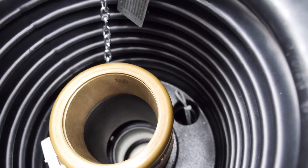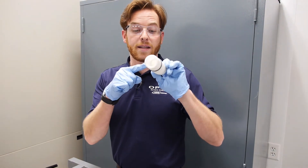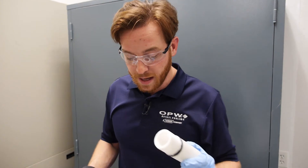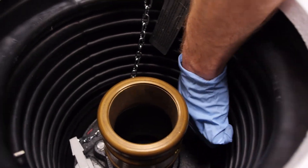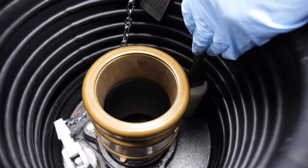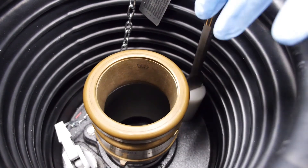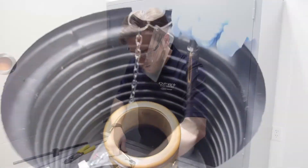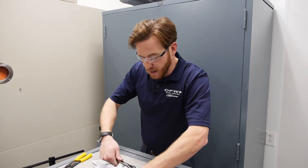Now before you put your white cap on, you want to run inside just to make sure everything is still working before that last step. So we'll put our white plug back in. You want to make sure that you spin it down enough that this o-ring gasket is compressed inside the interstice. That's going to be what keeps any water or fuel that comes outside of the fuel drop and is contained in the bucket — it's going to keep it out of the interstice. Make sure you get your loop there inside your white plug to keep it standing. Then get your wide flathead screwdriver or your chisel and tighten your plug back down. Once you get your white plug screwed in tight with that o-ring compressed, go inside and look at your tank monitor to ensure that there are no alarms. Then you have a fully functional 100% double wall edge spill bucket ready to be used.